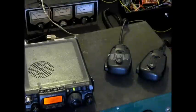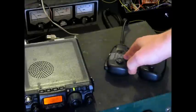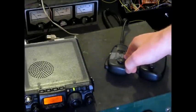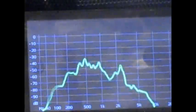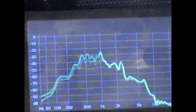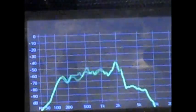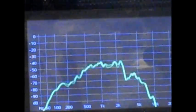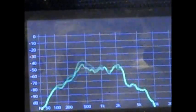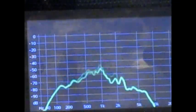Here's the FT817 setup with the two microphones I'm going to compare. The one I've done the mod to just has a temporary piece of sticky tape so I can identify it. This is the modified microphone, speaking about two centimeters from it, with the switch in position number two. The audio does sound a lot brighter and is probably more readable under poor conditions.